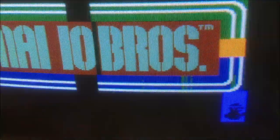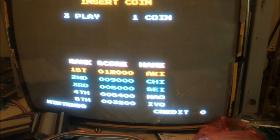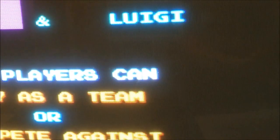I'm going to continue — I'm going to verify the ROMs and I suspect there are some funky ROMs. But I'll pull the other two ROMs and see if that clears up. I pulled the other two ROMs out of the board and you can see there's still sparkly nonsense there, so that sparkle is not ROM related.